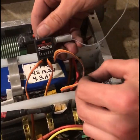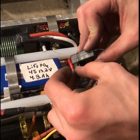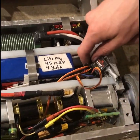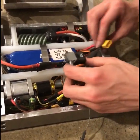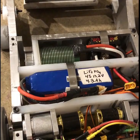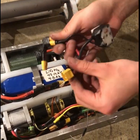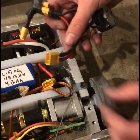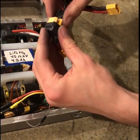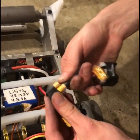We also have a power LED so that we know when the robot is on. And finally, we'll need to connect all of the heavy-duty power wires that run from the battery. We have this switch assembly, which has several of these yellow XT60 connectors, which I prefer because they don't rattle out whenever you don't intend them to. They hold together very nicely and have larger connectors so that they allow more electricity to flow safely.